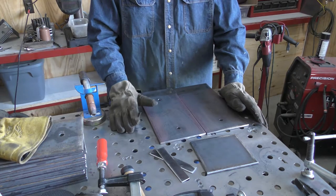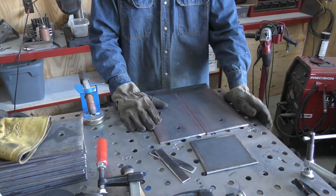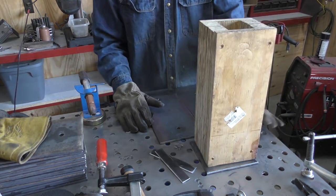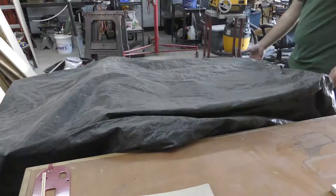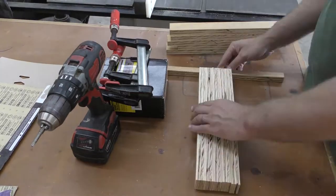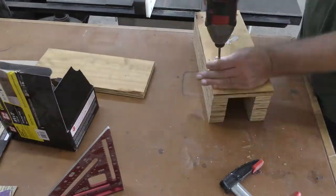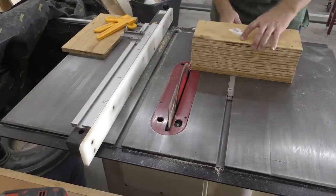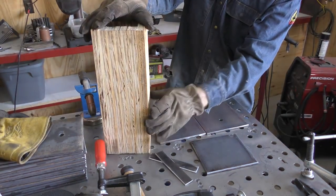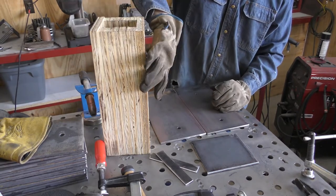So as you all can see, I've got three major components for these brackets here. I went ahead and made a jig or a little spacer to make assembly a little quicker. This really helps make sure it's always evenly spaced, which is at 5 and a half inches for the post. This way is not as thick, but that's okay — it's really just this side that's important.